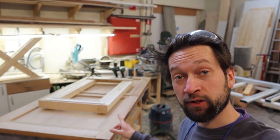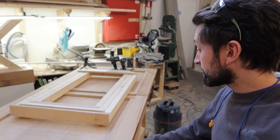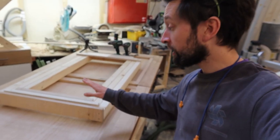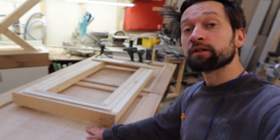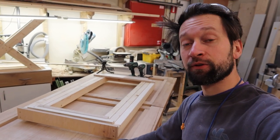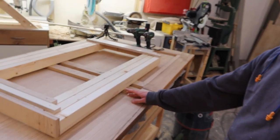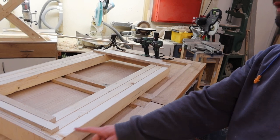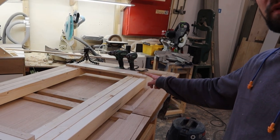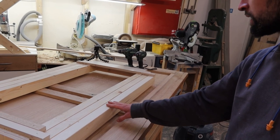The rails are now a smaller size and suitable between the legs of the table, and I'm gonna place the interface plates on which the rails and the legs get mounted, and this is screwed on, not glued. It could be glued as well, but for accessibility later on or something else, I'm gonna screw it, and you can see the rails are quite a bit shorter with the excess length cut off, and now the full length is the maximum stroke or travel, so now it's compact in design, so that's quite nice.